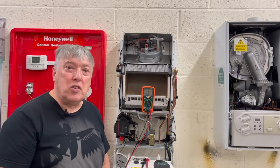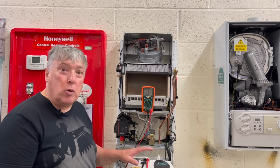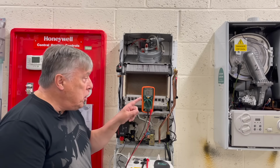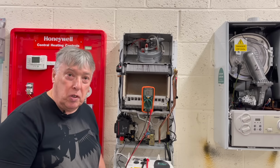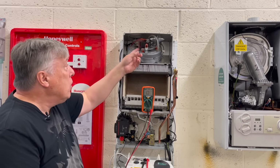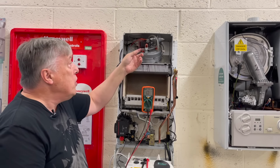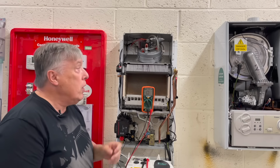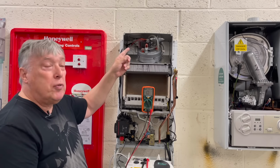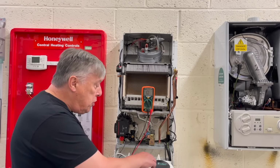Before I can test the windings, I've turned the power off to the boiler so it's nice and dead. I've switched the multimeter onto ohms, and now we're going to do the first part of the test, which is the spin. So I'm just going to gently spin it round, and I can see that there's no resistance there at all. Very carefully remove the live and the neutral wire from the terminals, and we're going to proceed in measuring the coil.